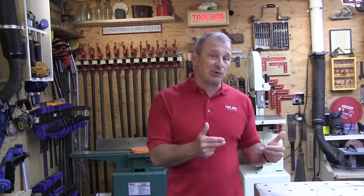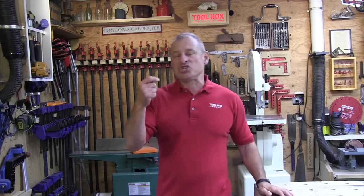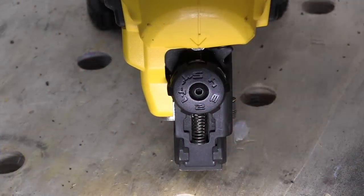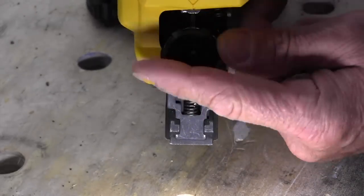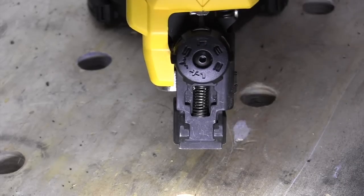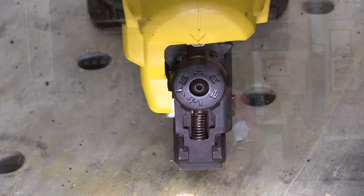There is no dry-fire lockout on this nailer — just be aware of that. The depth-of-drive adjustment wheel is top-mounted and uses a turn-knob mechanism requiring your thumb and index finger to operate. We found that depth-of-drive knob stiff and hard to turn. There are five settings on the knob, and during our project we had to put it on its deepest setting to install flush nails.